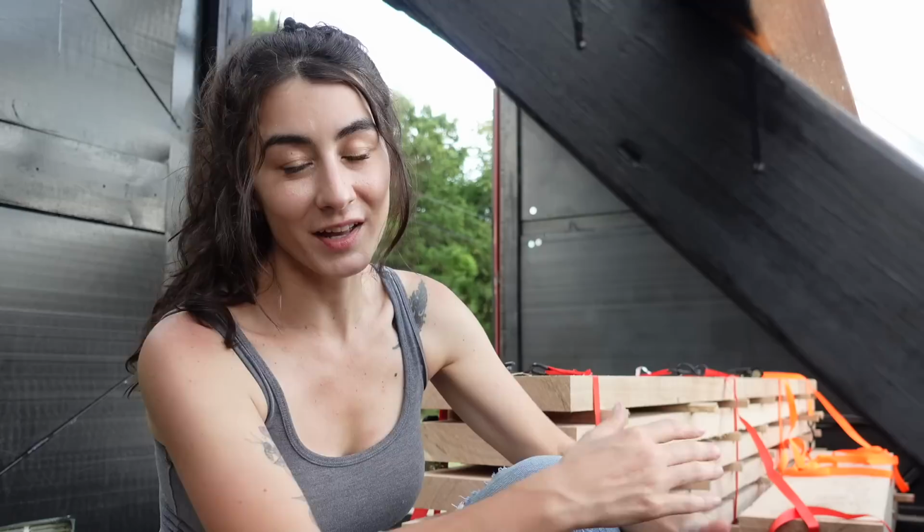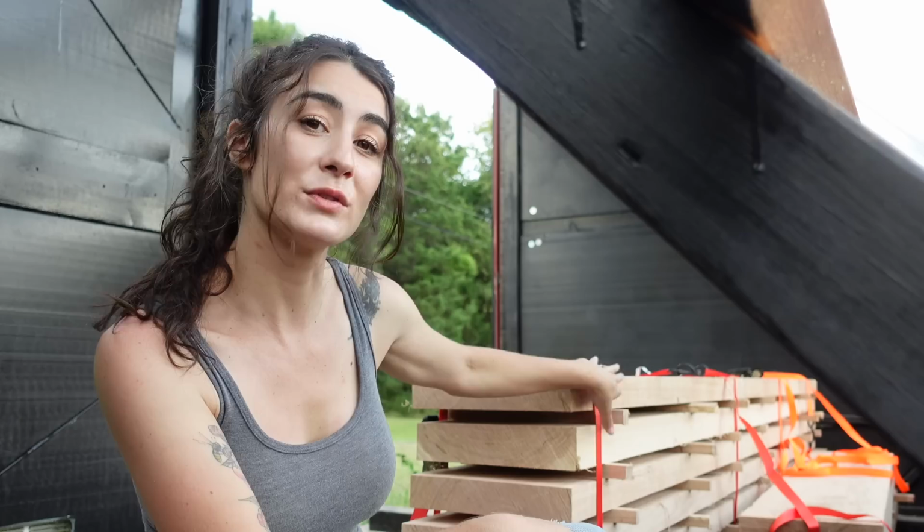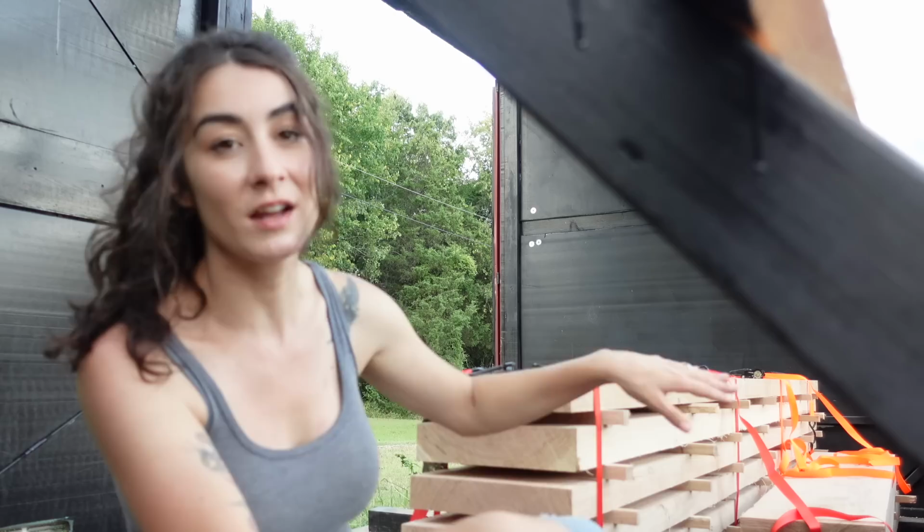We went ahead and loaded up all of this gorgeous wood into our solar kiln. It's going to sit here for a good couple of weeks. We're going to come back and check the moisture content. The reason is because you don't want to use green wood immediately, especially when you're doing a project. So you want that moisture to slowly come out of the wood so it won't warp or twist. Now, we did ratchet strap it down and we are using the same species as our spacers in between so that it won't mess up the wood or potentially stain it. I wouldn't want to use a black walnut on something like this because this is red oak.